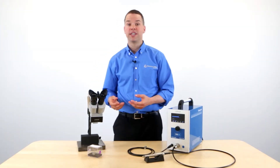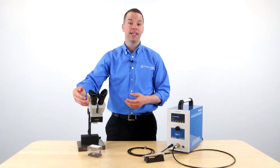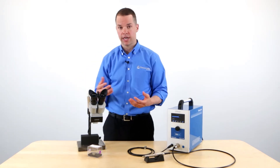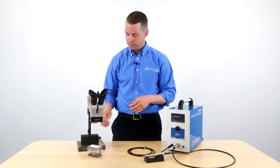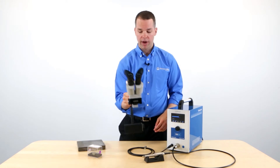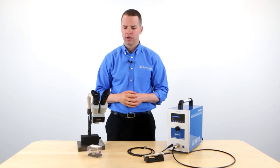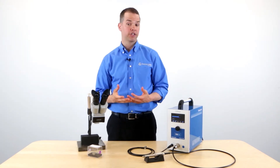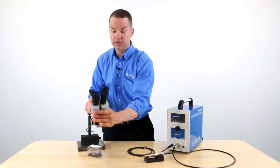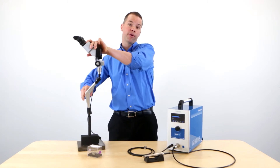The PUK microscope has many features that make welding easy. It has 10 power optics and an LED light, which is adjustable. It also has a built-in shutter that gives eye protection during the welding process. The base is magnetic, and it makes it very easy to maneuver the microscope around. You can connect it directly to your mold base or to your welding table. And finally, it's very flexible — if I loosen this knob right here, I can adjust in nearly any position, and we can even go vertical if you want to do an in-press repair.